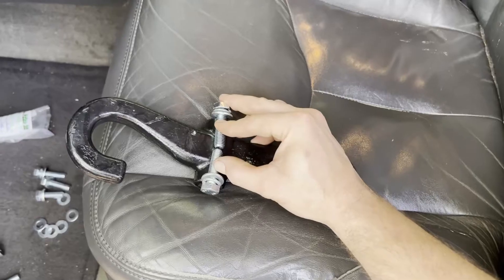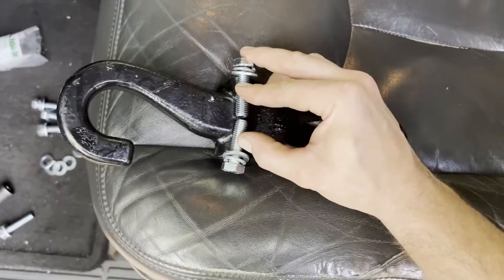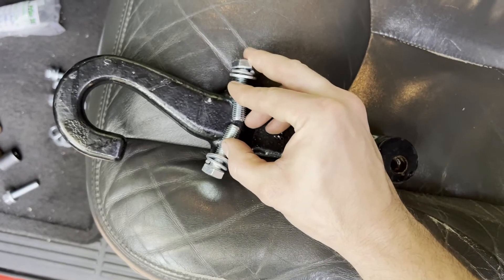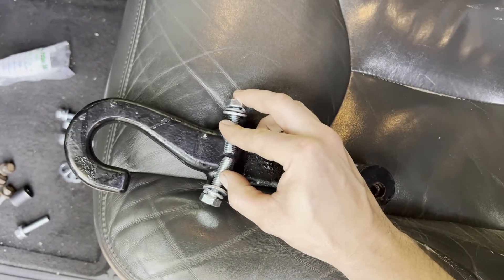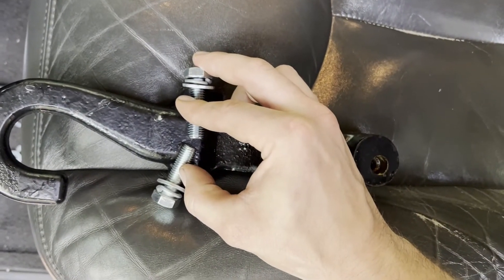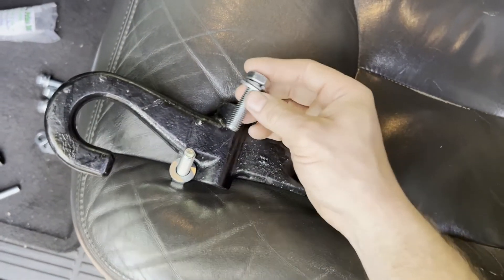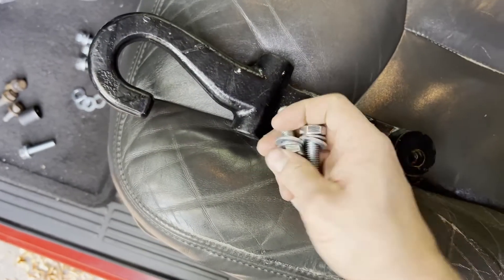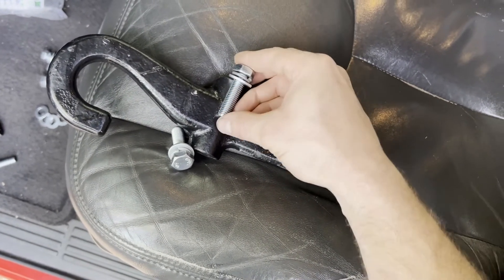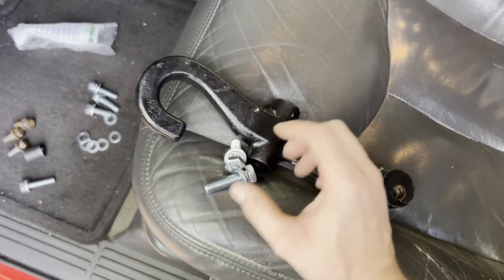In addition to blue thread locker, I'm putting a normal washer and a split lock washer on each bolt because overkill is underrated. These are M12 by 1.75 thread pitch bolts in three different lengths. The center section is drilled through and threaded except for a tiny section in the middle. I have a 40mm bolt coming in one side and a 45mm coming in from the other — if you tried using two 45s they would hit and it wouldn't get tight.